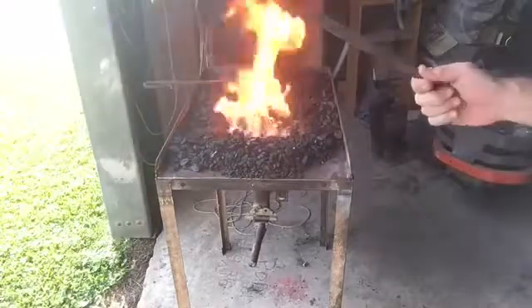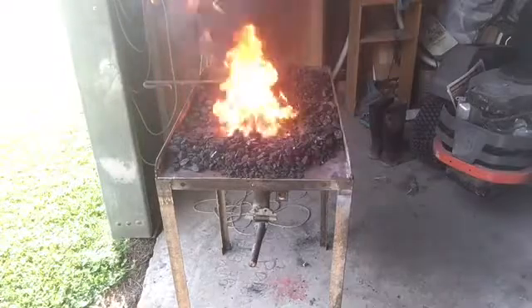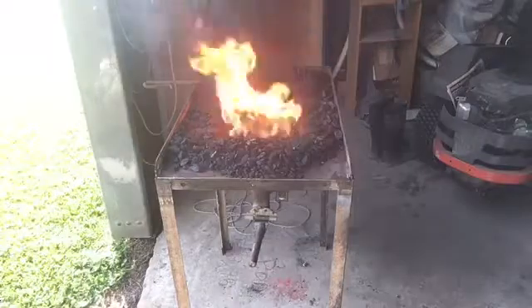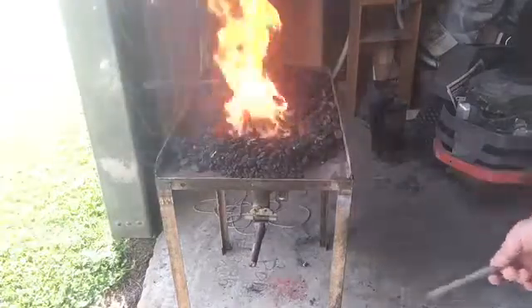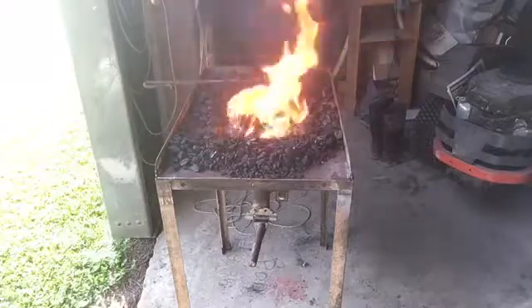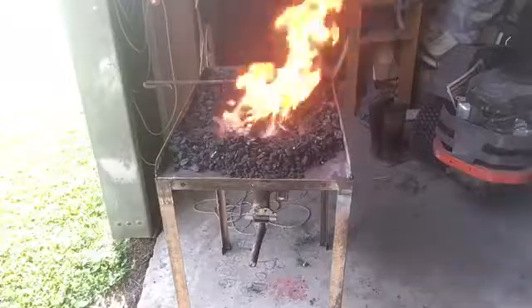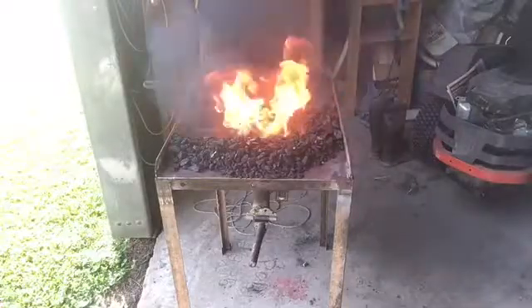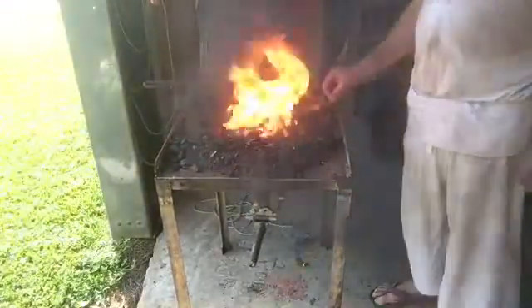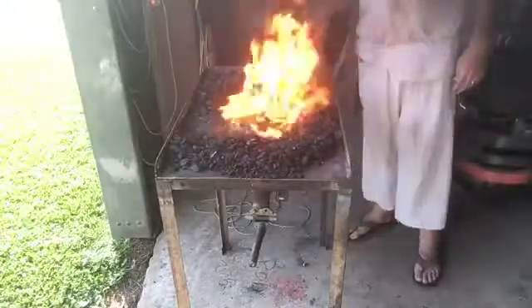This is a quarter inch bar stock. I'm going to stick it in there and see how long it takes to get it hot. I've only been burning this thing a little over five minutes now and I've got the air flow completely cut off right now. It's just kind of burning slowly, but let's see how long it takes to get this piece of steel up to heat. Get that in there, not too deep, but get the end of it into the hot coals and cover it up a little bit.